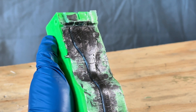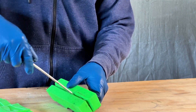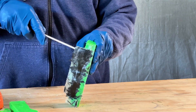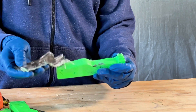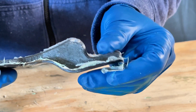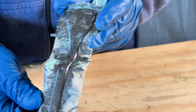You can now see where the top part shaped the contour of that door handle. Next we'll split apart the bottom half. Now we just gotta get the other half out, so I'm just gonna wedge right in here at the top just a little bit. And there you have it — there's my part. It definitely has some flashing to it but that's gonna be really easy to clean up. You can see exactly where the part lines are on the back side and along this edge here as well.